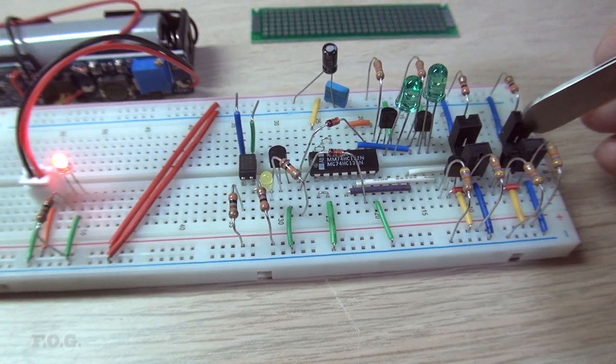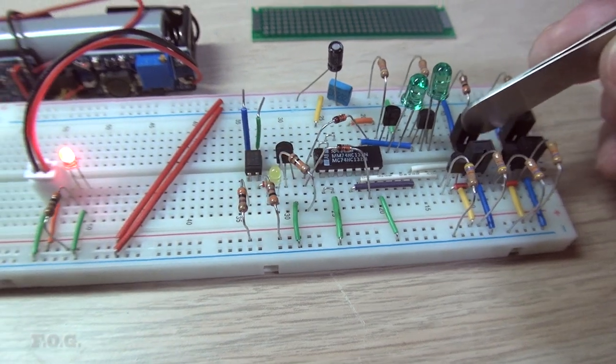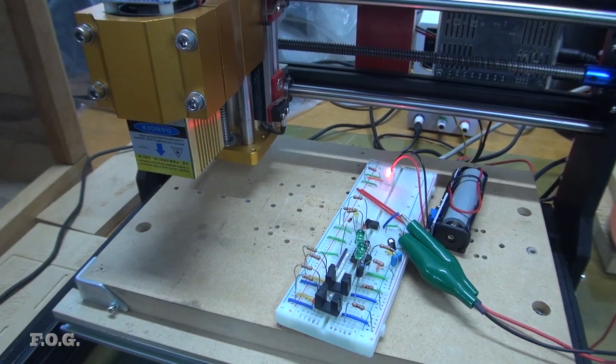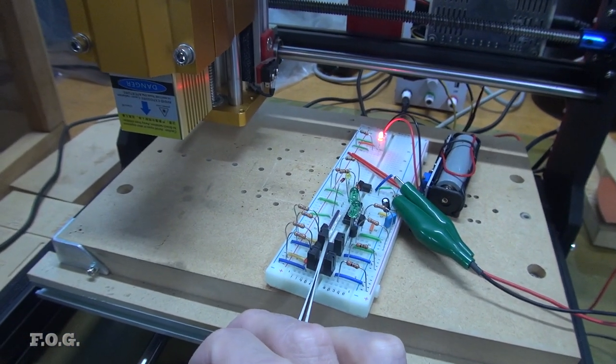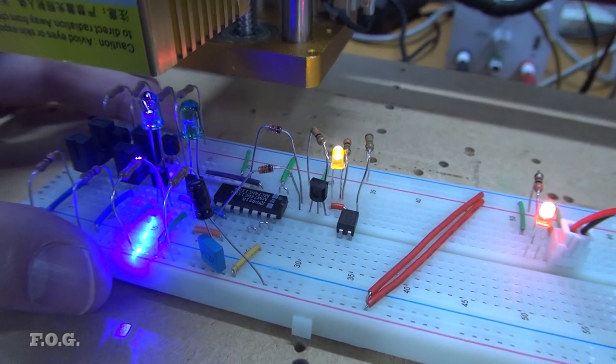Desktop testing showed the opto interrupt sensors working as expected, so the basic circuit should be fine. I also tested the optocoupler to make sure it would trigger the CNC correctly. And yep, that worked fine too. Next up, testing the sensor for the laser.